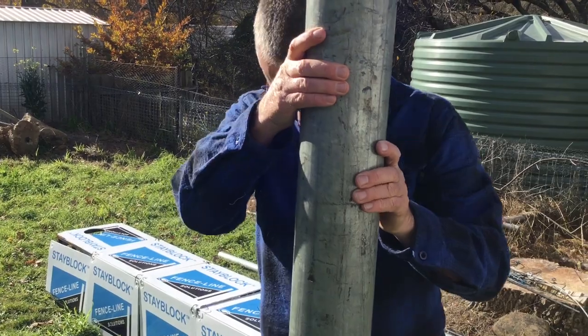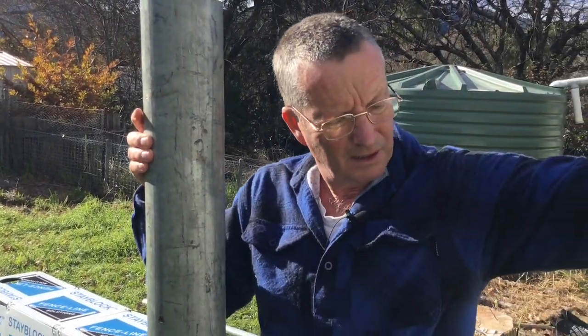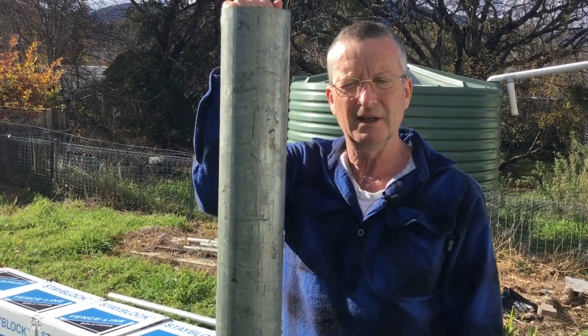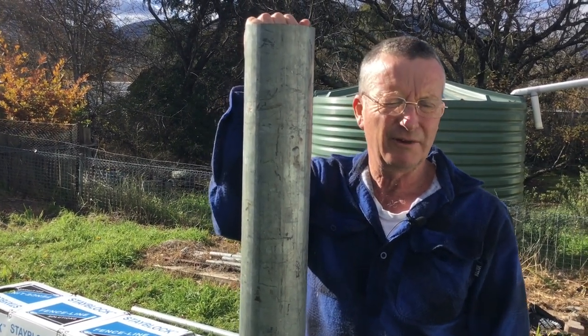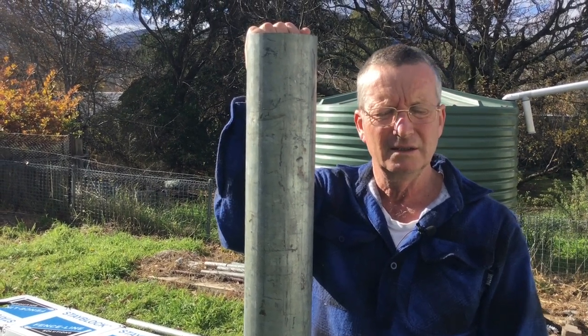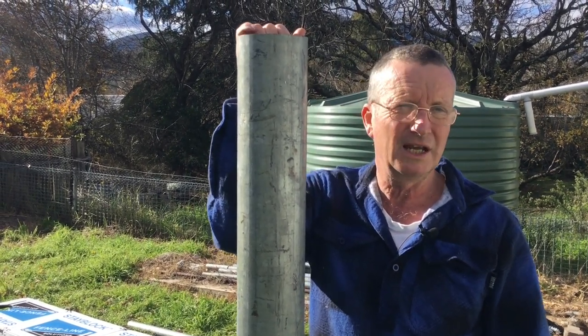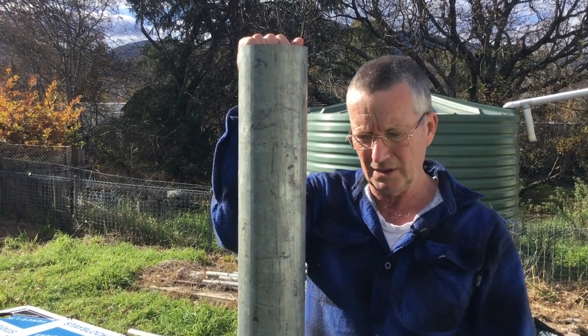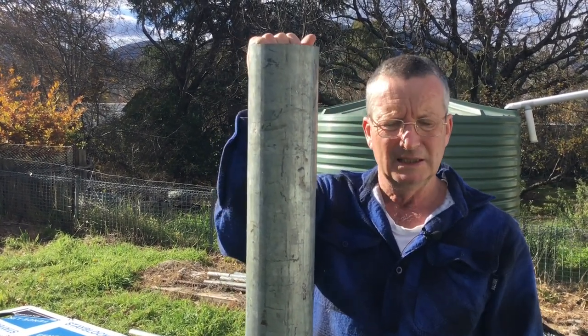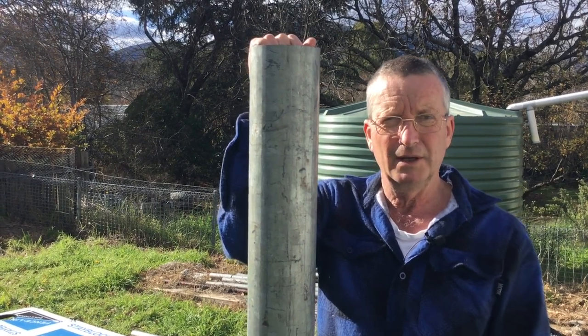If this is your fence line going this way and this way, we put them in on the side. It doesn't matter what soil — they give you a factor of about 2.8 to 3 in their resistance to jacking. And why they work so well is that they're down deep. Whereas if you're doing any bracing up the top, you're doing it in the mud when you've got trouble. So down deep is the way to go.